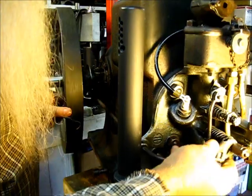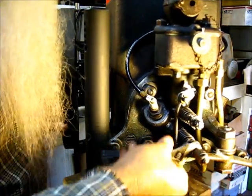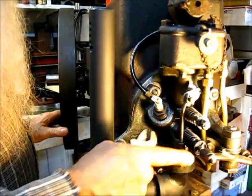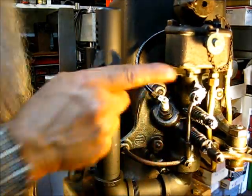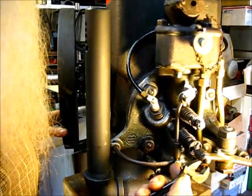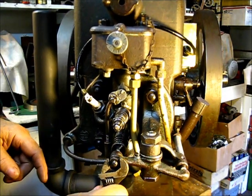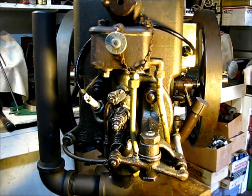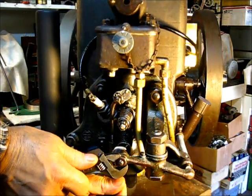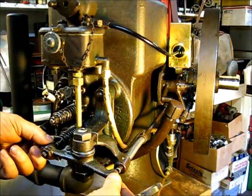What I'm doing is turning that little square head about one turn, and even though it's a little offset, if I turn it like right there it's more centered onto that bolt stem — that's kind of where I want that. I've got about a thread showing, it's not bottomed out, so I can make a little adjustment there. I'll snug that up enough to where it's tight. This is a weak place right here, so when you're tightening this up, you'd put a wrench on the inside there and tighten the two together — that way they're locked and you didn't put any pressure on this weak point.